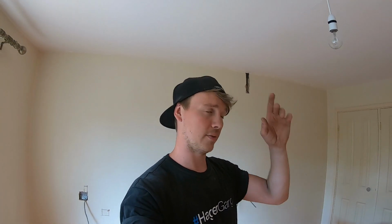I've had an emergency call for an electrician in Stafford, where I'm from, for Monday morning. Some guys I know, good friends who are kitchen fitters, went to fit a kitchen. The customer had said it's exactly the same, I just want some new units. They turned up, started ripping stuff out, and there's no 6mm feed for the new cooker. The cooker hood hasn't got an isolation point, the socket's in the way where the built-in fridge freezer is going to go, just loads of stuff. So they rang me up and said, we're in a bit of trouble, can you come and look? So I went this morning, had a mooch, agreed a price with the customer. We're popping there on Monday to get that done.